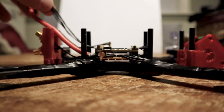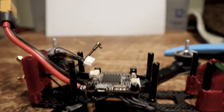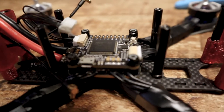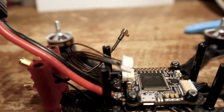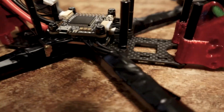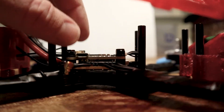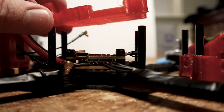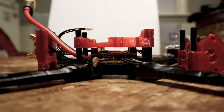This connector is for the air unit. From the side view you can see there's still plenty of space to fit it in. This is where you'll need the actual 3D printed bay for the air unit. The flight controller is now installed — here's a close-up of how it looks without the air unit in there. Everything is ready to go; once you install the air unit it's hard to get back off, so make sure everything's connected before you push it down over the stack.